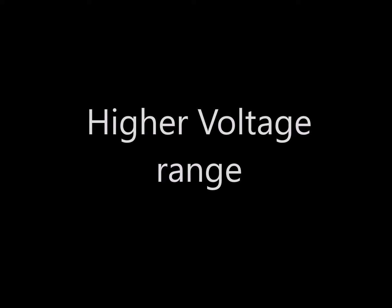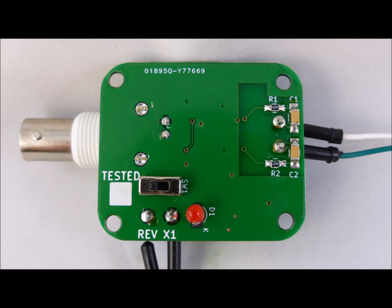The most significant change is that since they had a unity gain result with a 2.5 volt rail-to-rail swing, that would result in an input that is only 0–2.5V, and for logic you typically want to be 5 volts. So we put a 10-to-1 scaler on the front of it. We also wanted the power switch and the LED to be located on the rear of the card so that it could be mounted in a box.